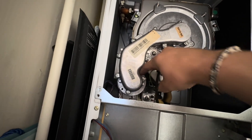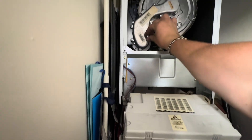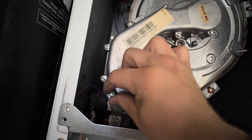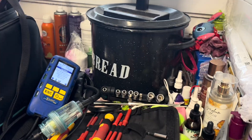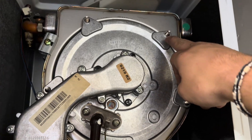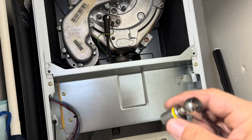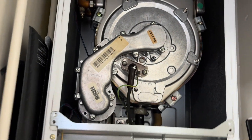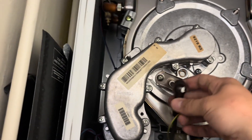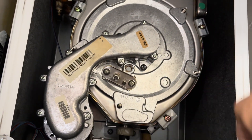What you want to do: there are two screws here which are just normal Phillips screws. Take them out, then you have five bolts which you can undo with just a small ratchet, size 10. Undo all of them and take them off. Next, pull off the spark electrode lead and the earth wire and put those to the side.